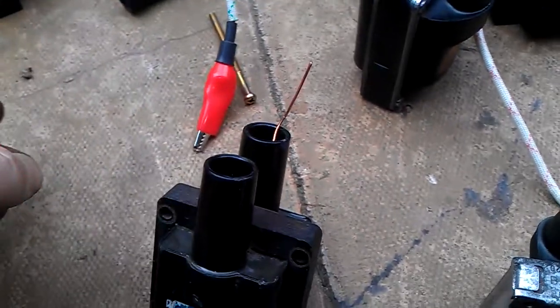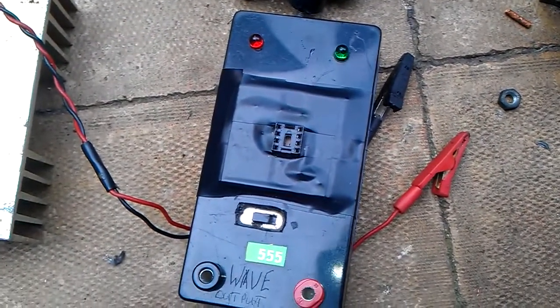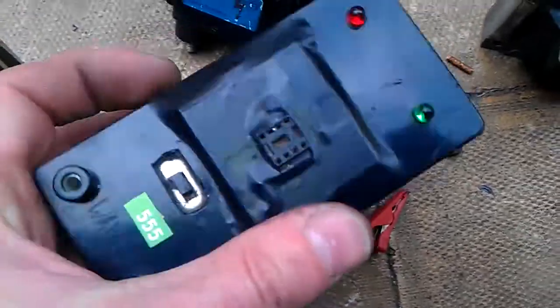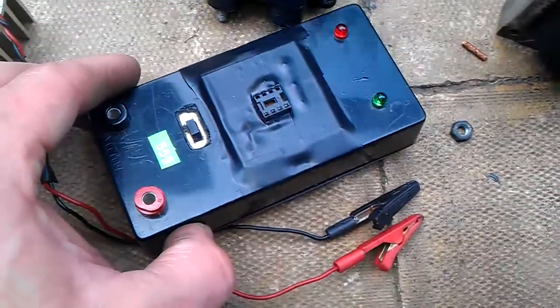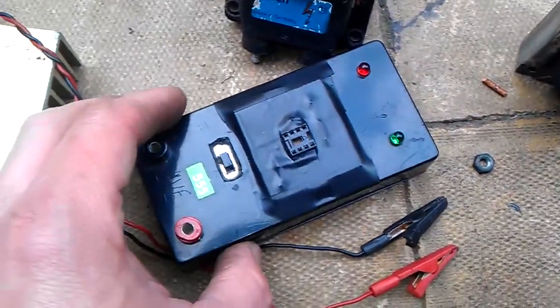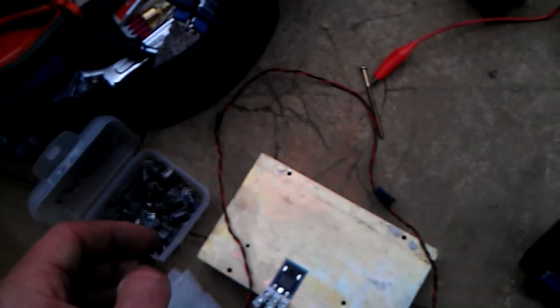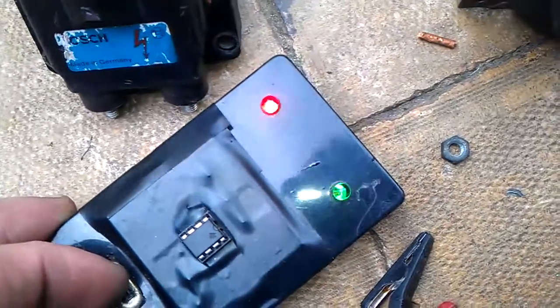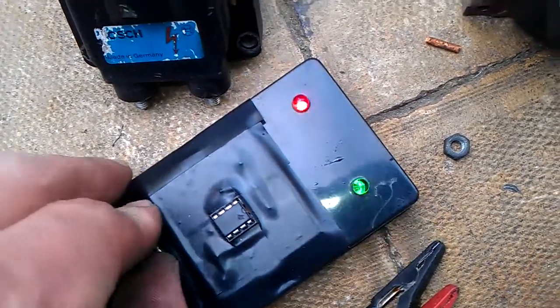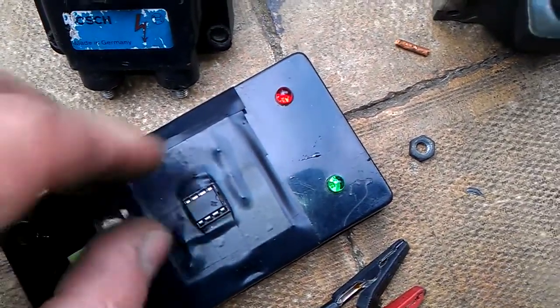The trouble with powering stuff like this with a 555 timer is you end up frying your chips. I've just fried one. I've got a little 555 timer chip checker which my friend, a good subscriber, Sparkfish, built and gave to me. I was going to build one myself but he said he'd sort it. I've got plenty of these chips — I bought them off eBay, six pounds for a hundred 555 timer chips. All you do is stick it in, switch it on, and the flashing LEDs — the oscillating — shows you that it's working alright. That one's fine.